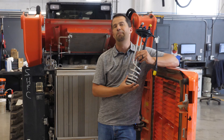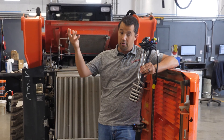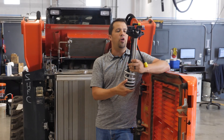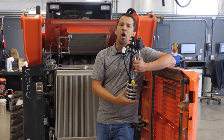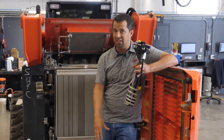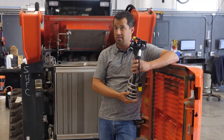If you manage to do that — which we see fairly frequently unfortunately in rental situations where the operators aren't familiar with the machines and they're trying to fill the thing up with fuel and they see a hole and they pump it — that diesel fuel will ruin this DEF sensor even with small amounts. It can go a lot further than that though; the plastics and the hoses used to handle the DEF, the urea that's in your DEF tank, none of them respond well to diesel fuel. The sensor is just the tip of the iceberg. So when we get into a system that's had diesel fuel put into it, we're often flushing tanks, sometimes replacing them, flushing and removing the rubber lines that go up to the rest of the machine's exhaust system in order to get that diesel fuel out. It can ruin the whole system very quickly.